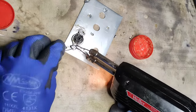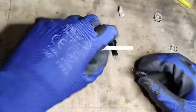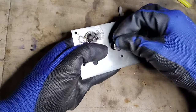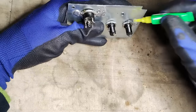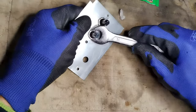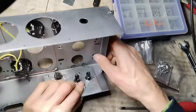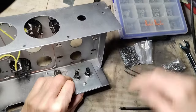This plate also becomes a convenient place for installing a loudspeaker connector and two fuse holders, something that was completely missing in the original radio. The fuse holders are secured with super glue to make sure that they will not turn while inserting or removing a fuse. The plate is installed from inside the chassis using small screws, spring washers, and nuts.